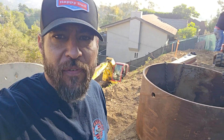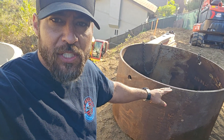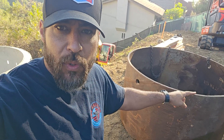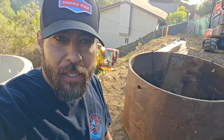We've had an issue here — we've hit some hard rock. When we hit hard rock, or a deposit we call cemented bedrock, we can't just normally drill right through it. So today we're going to be fabricating a coring barrel. This piece of steel behind me weighs about 2,700 pounds, it's one-inch thick sidewall, and we're going to fabricate a five-foot diameter coring barrel so we can cut through the rock.